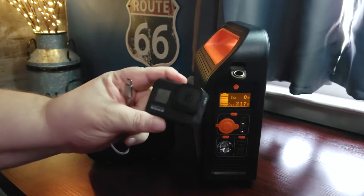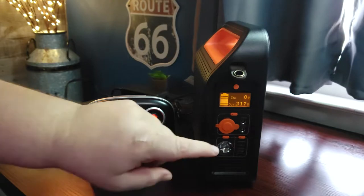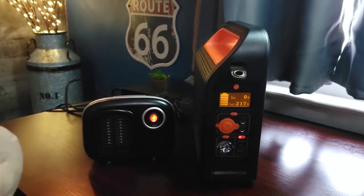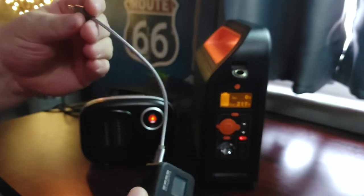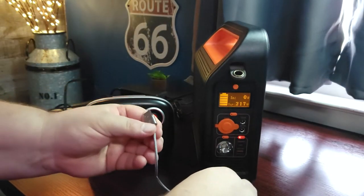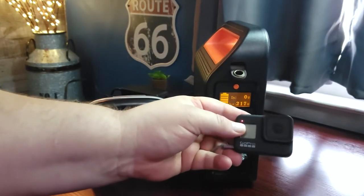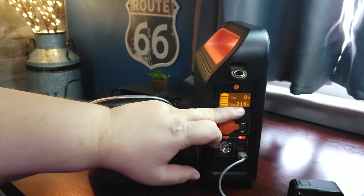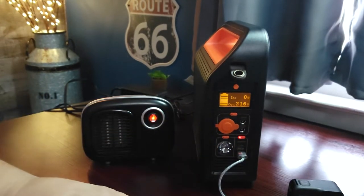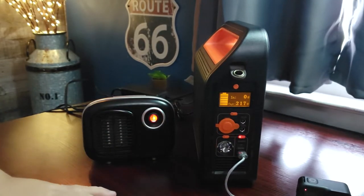Next, let's go ahead and plug in our little GoPro on the USB port. We'll turn it on and plug our USB-C cable in — it has USB-A on this side. The GoPro is charging. The watts haven't really changed a whole lot, sitting around 216 to 217. The GoPro doesn't really use a whole lot; that port maxes out at 5-volt DC.